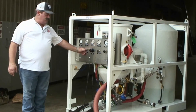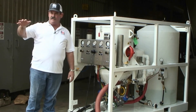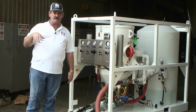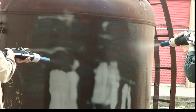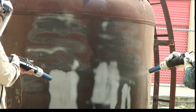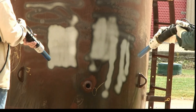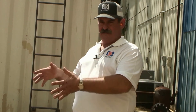At this point, I'm going to turn the water off to both nozzles and allow the nozzles to run dry so they can actually dry that work piece. By simply pushing the switches back in, my air pressure stays the same but I will get no water. Understand that the hose is wet and it will take 30 or 40 seconds for this blast hose to dry. We shut the abrasive off and turned the water off, so the operator can now sit out there with just compressed air and dry that work piece off so you can get your testing done and get a coat of paint back on.